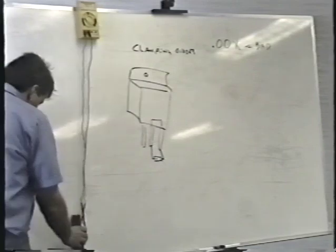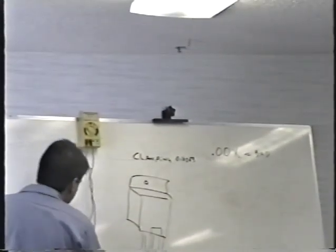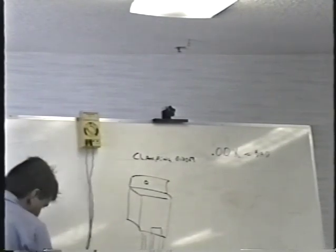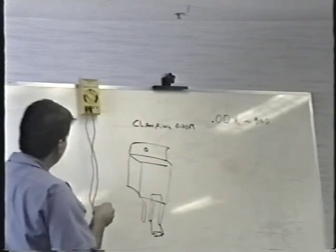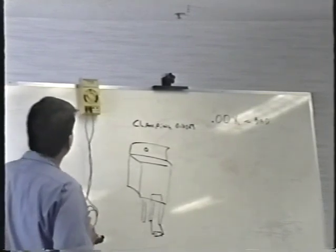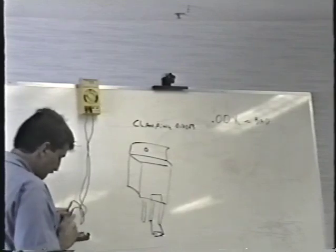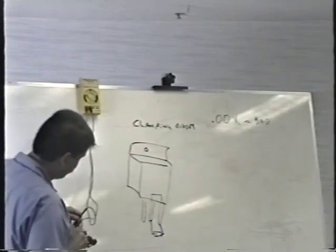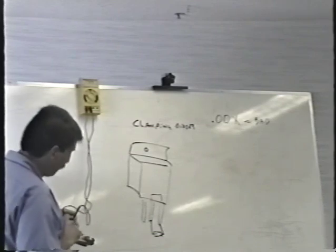For instance, when you check them in circuit, if I check from anode to cathode, in circuit, you usually see about 0.1 on this meter. It depends on the power supply. This one says about 0.2. It says 0.197, really. I'm going right across the 12-volt diode. From one side to the other, I get 0.197, and I get the same in both directions.